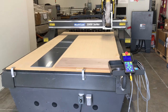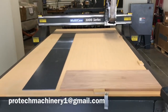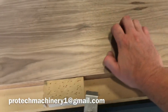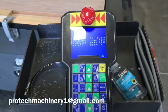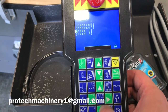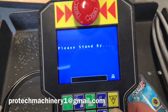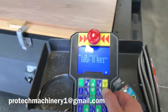The spindle's warmed up — we're ready to cut. Without dust collection, I'm not going to cut a whole bunch and make a huge mess, but we will show you something. We're going to turn the vacuum pump on. The suction's good — even with the whole table leaking, it still holds this piece with no problem. We'll scroll down to the PTN folder and grab our program called BuyMe. It validates the job, makes sure everything's in bounds, and we're ready to start.